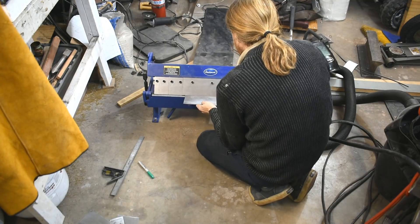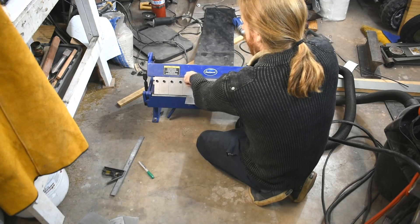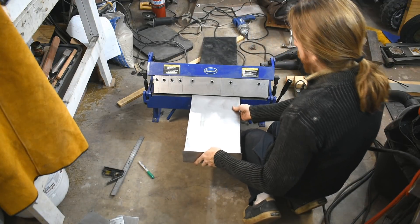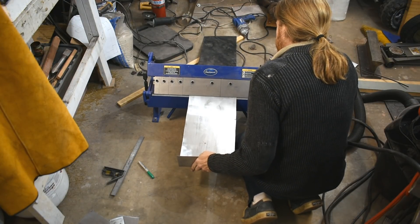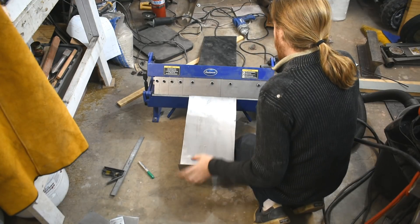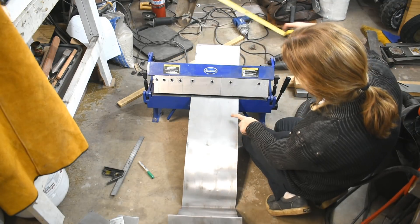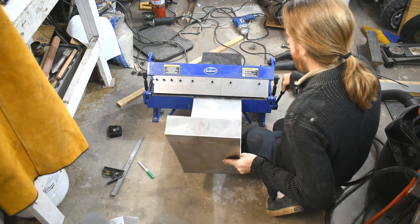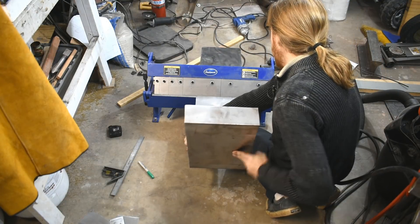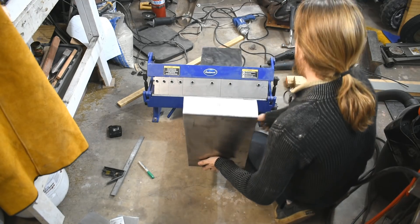Do not be fooled by this giant Eastwood logo right here — I am not sponsored or affiliated with Eastwood in any way. Is this even tight? No, these are not tight. I really like this metal brake. This is a pan brake, and that won't come into play for this particular part, although in a couple parts later it might. Actually, the pan brake feature has nothing to do with this build, so if you don't have a pan brake, don't worry — you can still build this, although you are definitely missing out. And would you look at that — the marks I made from the other direction actually line up. That's a good sign, that rarely happens. What I'm doing right now is basically getting it kind of tight and then making some fine adjustments to get it right where I want it. Once I achieve the fitment I want — where I know it'll put the crease where I want — I crank it down and bend it to about a 90-degree angle. This brake will go a little further, most of them will go a hair further, but there's bounce back.